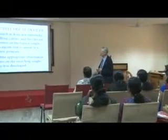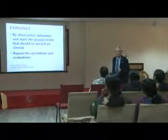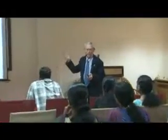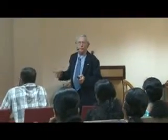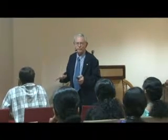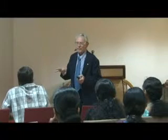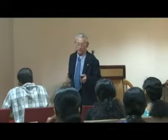And more, keep track of it. You keep good notes. You finally got through the first one, and you finally decided, I can live with the first operation. Now try the second operation, and on. And you keep going through the steps, one step at a time. Don't jump ahead and say, well, I'll open three breakers. You don't open three breakers, you open one, and two, and three, and see at each step what the impact is on the system.